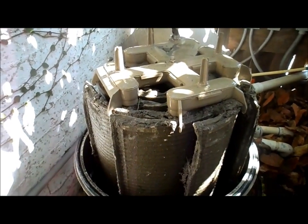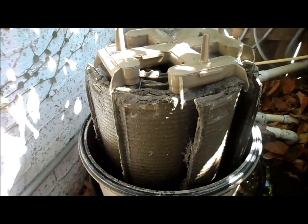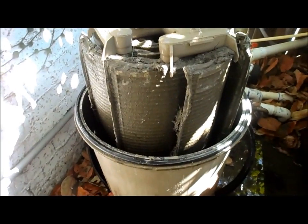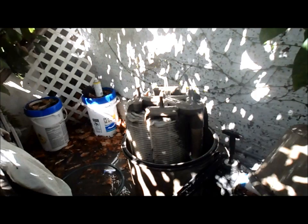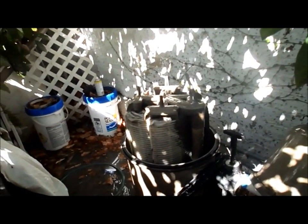The Leslie brand filters also have this top manifold configuration. Pentair does make an A4000 series DE filter that doesn't have a top manifold, and that's a really good filter if you're going with a DE filter versus having one of these top manifold types. The drawback of a DE filter, of course, is that it's really messy when you clean it.